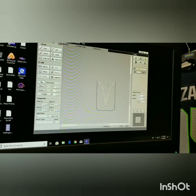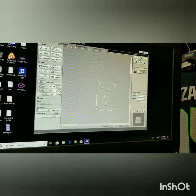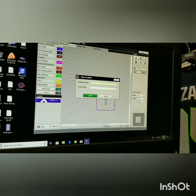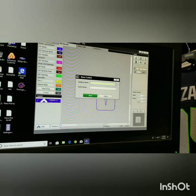Next we need to join all these segments together. It's very important to join them in order so that the machine will cut properly. Just click right around the design to join all the segments together. Then we're setting the bevels — I need to tell the machine how I want it cut. I'm going with a 45-degree bevel on this one. Then I save it in my program as a piece of cut art under my category 'Meg's Cut Art' and call it 'Seahawk.' Save it — BAM, how easy is that!